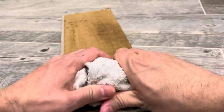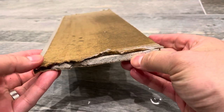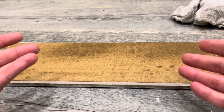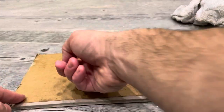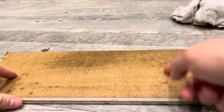I'll put a bit more water on just so you can see it seep through. Once it's bent in the exact shape you want, let it dry. Here are a few quick tips: if you're going for just a slight curve, you probably won't need to make any cuts — just wet it and you should be able to curve it nicely. For a more aggressive curve, put cuts along the back every few inches depending on how aggressive the curve is. Then bend it based on those cuts, screw it in place, and mud over it — it'll all look smooth.